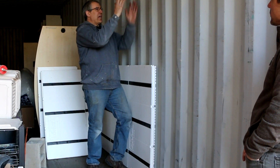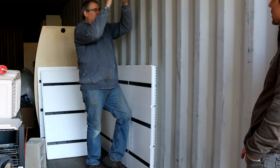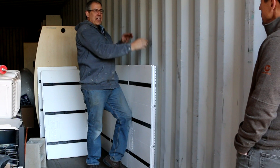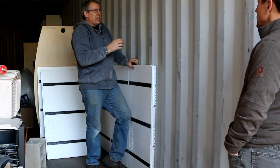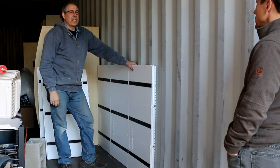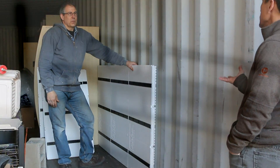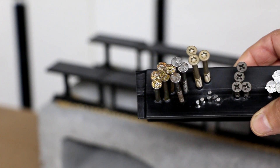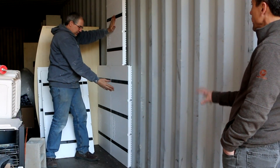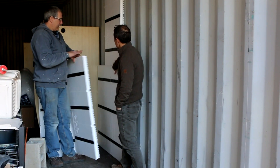When you load up that cabinet hanging out from the wall with a hundred pounds, there's 25 pounds of load per screw in shear, but there's also some pull-off. With a hundred pounds in the cabinet, it calculates to about 30 pounds of pull-off, which is more than capable for a single drywall screw. Using cabinet screws, we've tested over 300 pounds of pull-out — it would take 300 pounds to yank that screw out of the stud. You can really place these studs anywhere you want; you're not limited to the factory's 8-inch spacing since the interlock holds everything together.